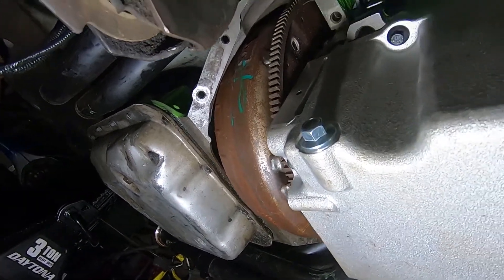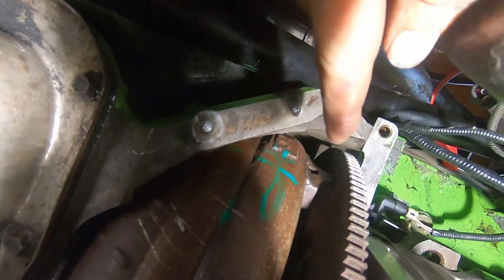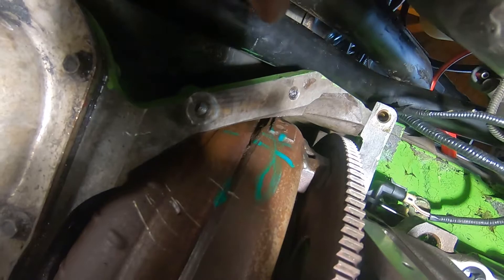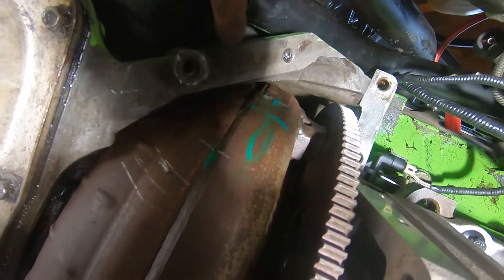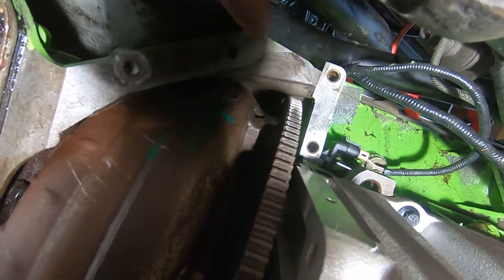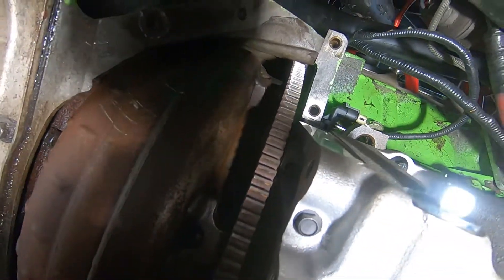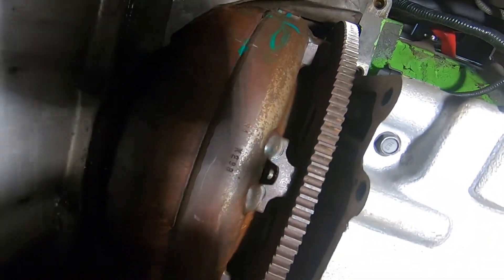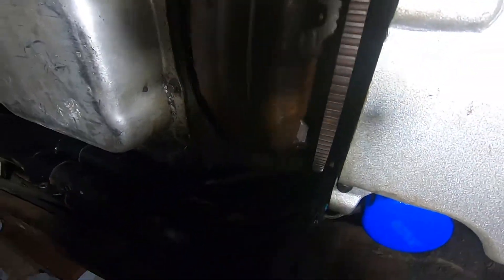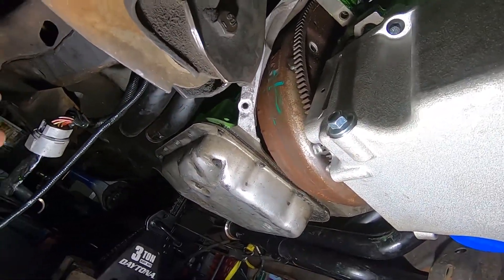For those of you going to do it yourself — the little knobs up in there were just a little bit above the holes on the transmission side because they're on the engine. So literally all I did was use the weight of the truck to help push down on it, and it pushed into place. Got her all nice and in. I'm still waiting on the crossmember.